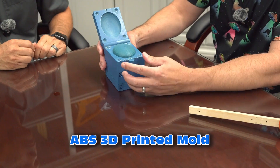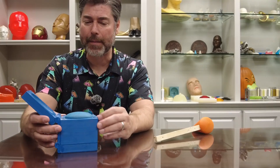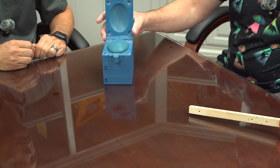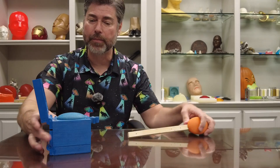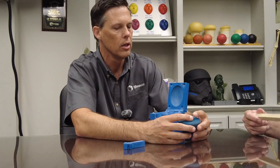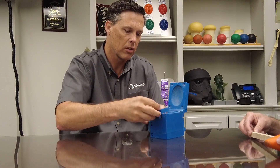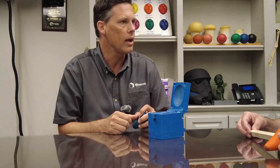On a mold like this, since you're casting a flexible foam part into a rigid mold, everything is pretty straightforward because the foam can compress. But the interesting feature is the little slide. When tackling the problem, Troy had existing arms and wanted to incorporate something that fit on the end to protect them from impacts in multiple directions. If the geometry were just 3D printed solid, you couldn't demold the part — so it has to be a slide, which is very common in high-end manufacturing tooling as well.